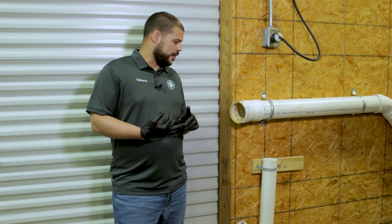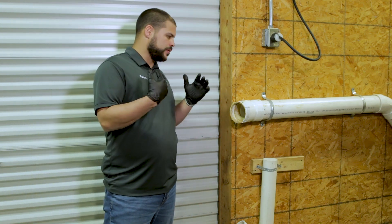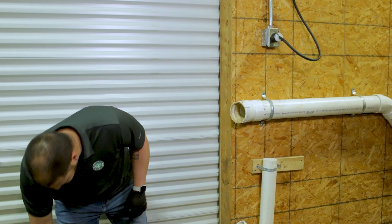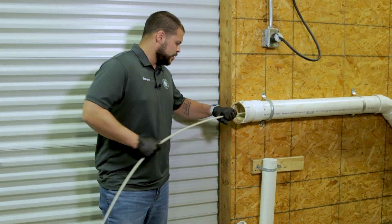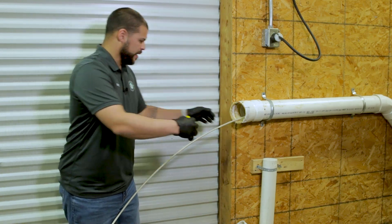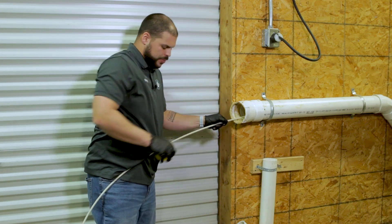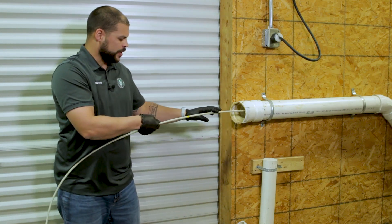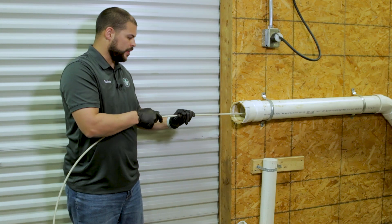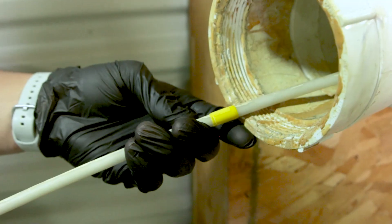The next thing we want to do is make sure that the pipe that we're repairing has been cleaned. You have televised it to confirm that it's clean — so free of debris, roots — checking to see if there's any offsets or turns in the pipe. We want to make sure that we can get our repair to the spot in the line. So we'll actually take our camera, put it in the pipe. Once we've verified that we're at the spot we want to repair, grab the tape that comes in the kit and tape right at our access. Make sure the tape is on there extremely well, because we don't want to go in with our dry run after we've transferred and not hit our spot of repair. We want to make sure this is taped really well and that it's exactly at the edge of your access point.